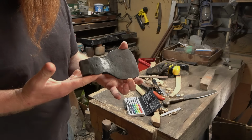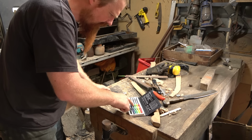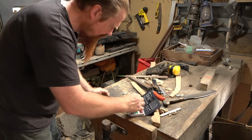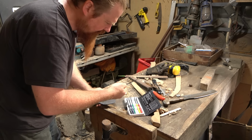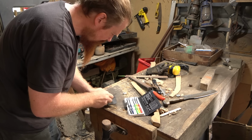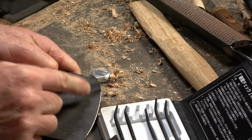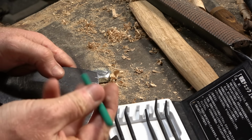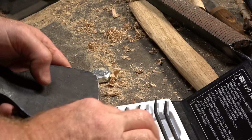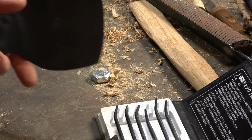One hour, go. One tempering session done then. Let's see how much we've reduced it by. So we're aiming for 55 ideally. So it's still harder than 45. 50. 55. Hey. Yes, I can just about put scratches in with that, which is the 55. That's perfect. I'm going to do another hour at the same temperature, and then that's the heat treatment done.